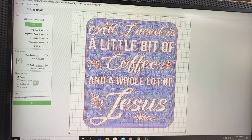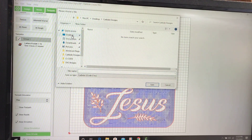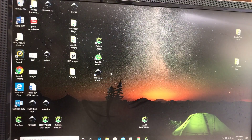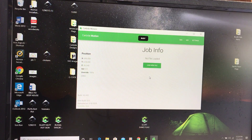My tool is a 1/16 inch end mill made by Amana, bought from Tools Today. I left all the stock settings alone. Start depth is default, max depth is 0.125 - which is an eighth of an inch - that's how deep it cuts around the letters. I've got it set to pocket. I always name the toolpath at the bottom so I know what bit it uses, like 'letters pocket 1/16,' then I hit Save G-code, go to desktop, save it to my G-code folder as '777 Jesus Coffee 1/16 bit.'